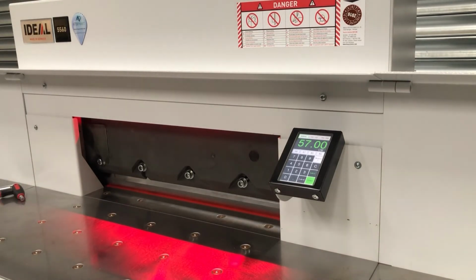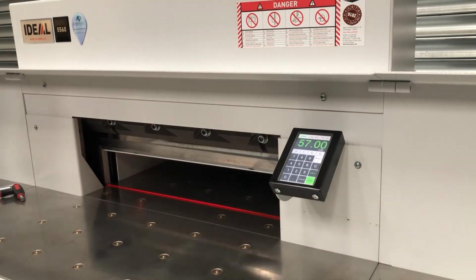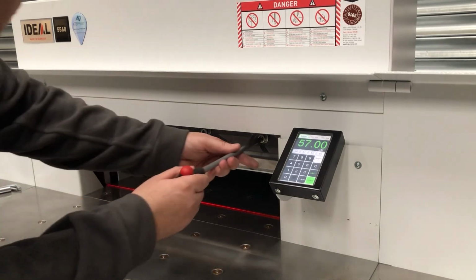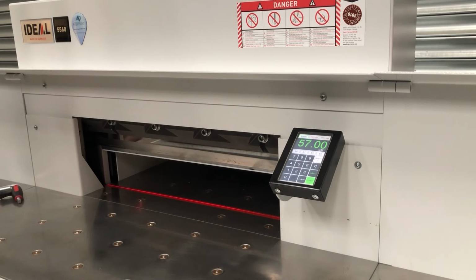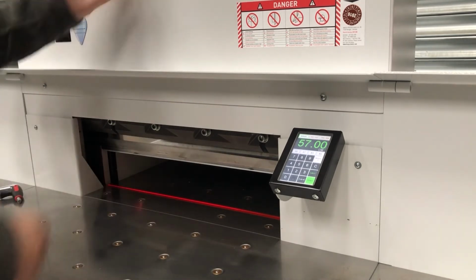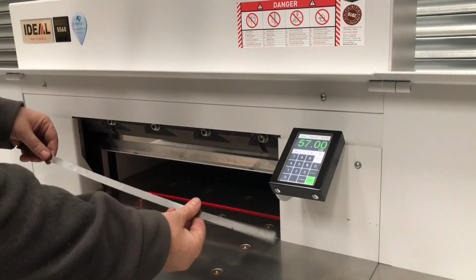Now pull the plunger back out, blade retracts to the top. Just whilst we remember, we'll tighten the blade bolt up on the right hand side. Again, just nip it up. Now what we need to do is replace the shim back underneath the cutting stick.